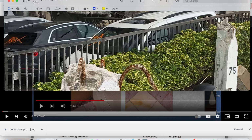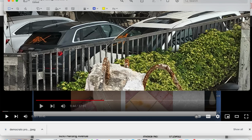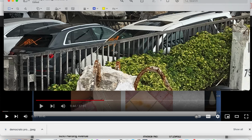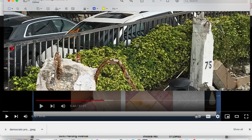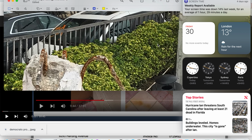That was removed when they changed the elevation of the pool deck up 1 foot to equal the same elevation as the parking deck. When they did that, they removed the BMA, saving what I call Cadillac money back then. They probably could buy a Cadillac or a few of them when they changed it there. They also changed the slab drop detail at the main structure from 2'6" down to 1'6". That's more Cadillac money, buying Cadillacs. And let's get away from that.